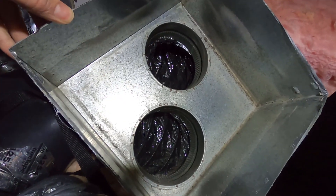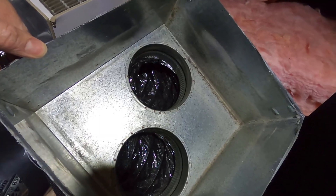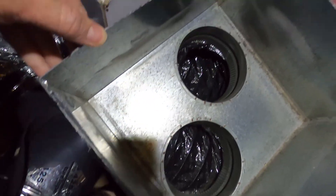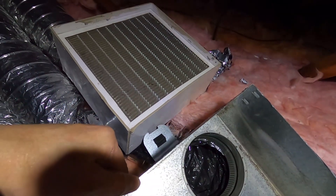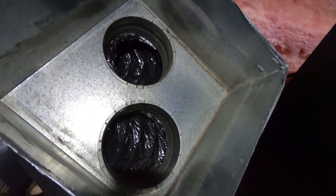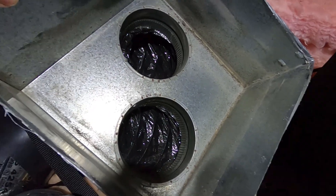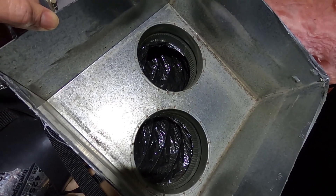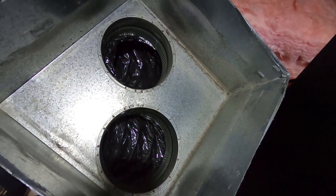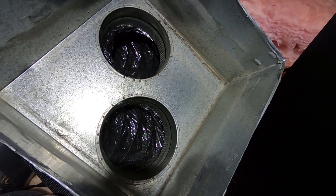Taking a look at the ducting side of the box, you can see a lot of dust collecting around the edge here. The reason for that is it looks like this last filter wasn't installed correctly. Reading the instructions on the new filter install, the filter is meant to be taped in. So I'm just going to give this a quick vacuum out and then we'll install the new filter.